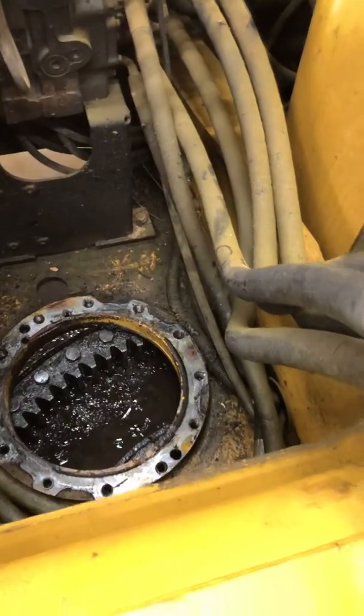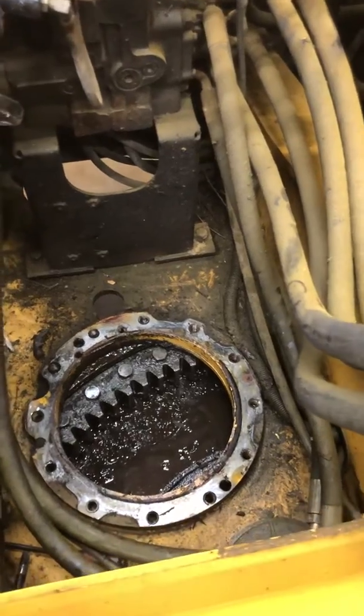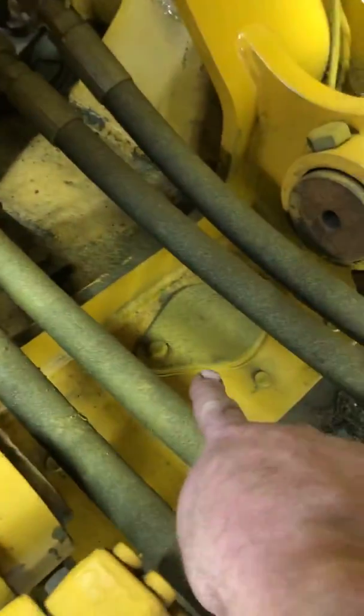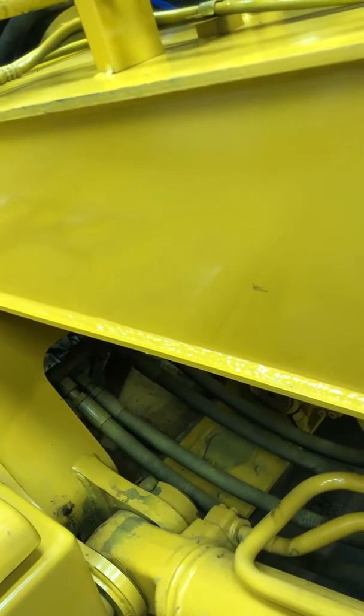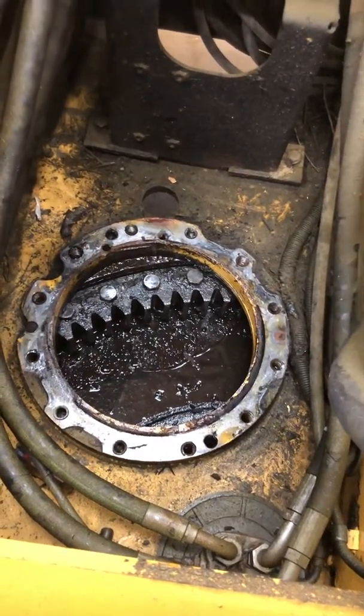Once we get that cleared out, the procedure is to take 30 tubes of grease down in the gear case. There's a little hatch on the front side of the machine that you pop open, rotate the machine a little bit, stab a whole tube in, and push all the grease in — basically use it like a little plunger. Just keep rotating and repeating. 30 tubes later, you can see this one has been run pretty dry, but hey, it's not a bad machine. Thanks for watching.